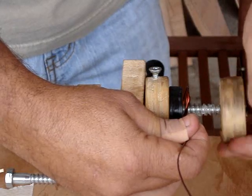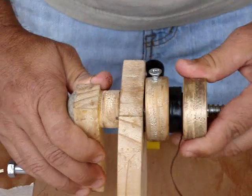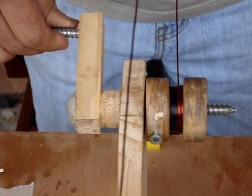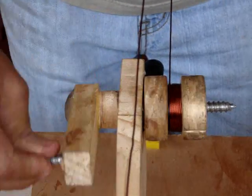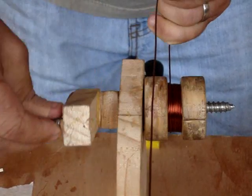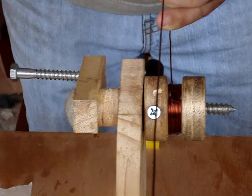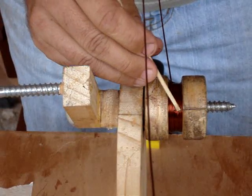I clamp it here on the end and now I'm ready to start winding. I've used a five-minute epoxy — off to the side I put a couple of dabs of the two parts so I can mix up each little section as I go. I put the epoxy on after the first row, applying it in about three different places. I don't coat the whole thing, just enough to hold it tight so when I tape it and cast it in the stator it holds everything together.